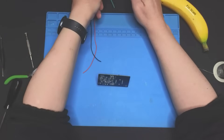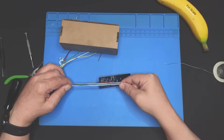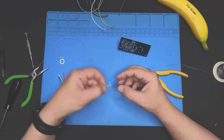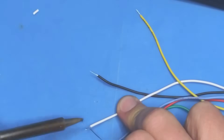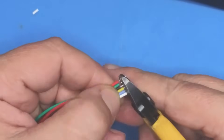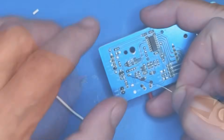What we need to do is connect a bunch of wires to this. I'm going to use red, black, green, white, yellow, and blue - I want at least three quarters of the way across the board, plus another four inches. Let's strip these off and get them tinned so we can roll little twists. I'm soldering most of the wire but leaving a little blob right at the end, putting a little blob on each one at the base, then lining them up and snipping them off.